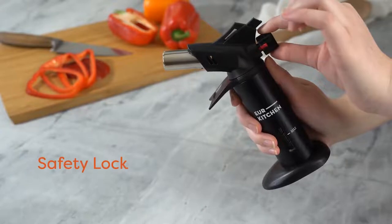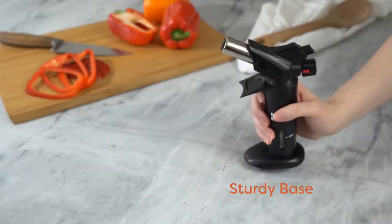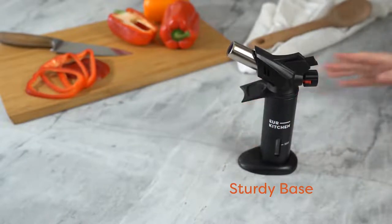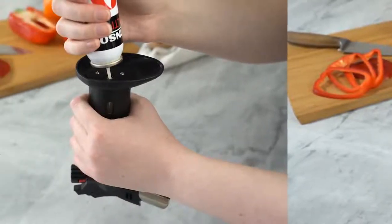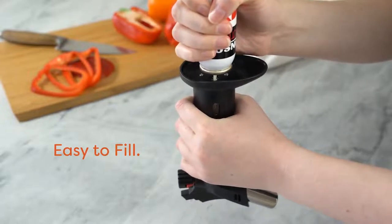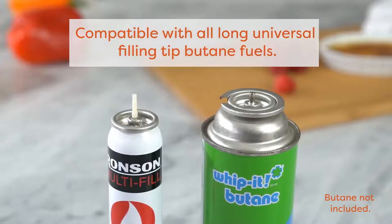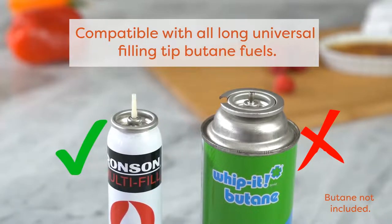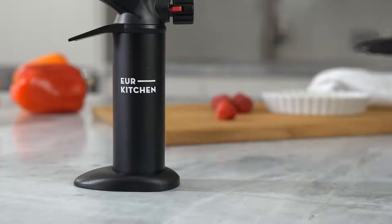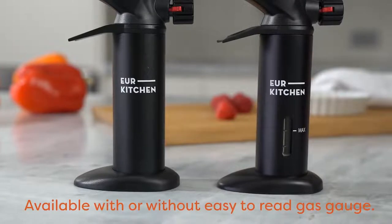What makes this torch a little more unique is the lack of a trigger. To turn the torch on, you have to release the safety lock, turn the gas flow knob on completely, and ignite the torch by pressing the ignition button on the back. Though this sounds complicated, all the buttons and knobs are positioned to keep your hand away from the front where the flame is. Though there is no trigger, meaning the torch is on continuously, you'd never have to get near the flame to use this torch, making this one of the safer torches on the market.